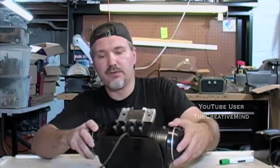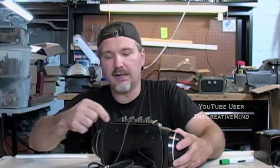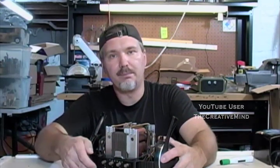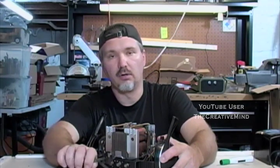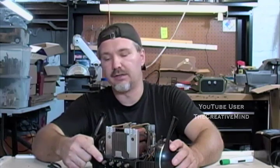But if you're looking for some bare metal, the bottom side of this plate is bare metal because, let's face it, you put the transformers down, you're moving them around, you're wearing away that paint. So if you take the magnetic clips, put them on the base of the transformer and that really thin lip, and then do all your appropriate readings, you should have no problem finding any issues with the transformer, like I did here with the bad ground thumb screw.